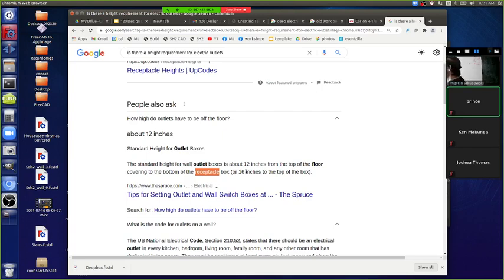What are we cutting the plywood with? We would drill through and then put in a reciprocating saw blade. So drill through, probably two corners, the opposite corners, a little drill hole big enough to get a reciprocating saw blade in. You can go one way and the other. It's hard to turn corners with those, so probably drill two opposite corners and go the other two directions. So, reciprocating saw.